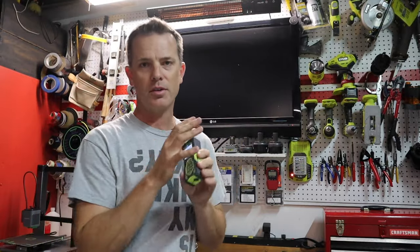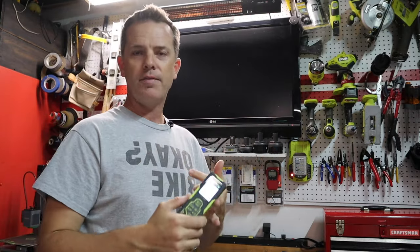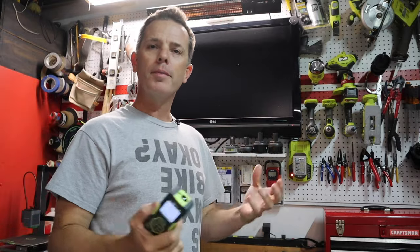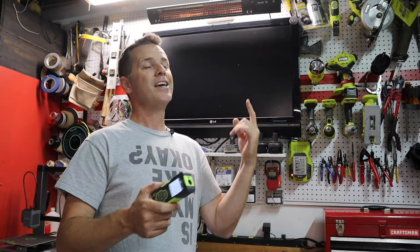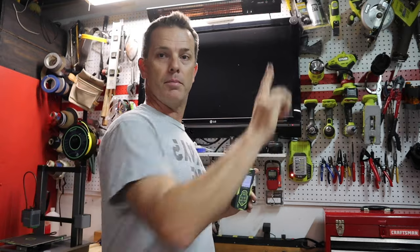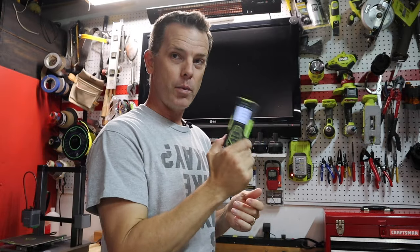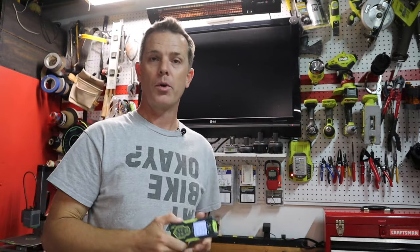You can also go metric with this if you have to. This is a big help if you're doing things like air handling or HVAC — it's very easy to calculate cubic footage even in a huge room. One thing to be aware of though: in my case this number isn't really accurate because I have a vaulted ceiling in here. It's calculating cubic feet by taking three measurements but not taking into account the vaulted ceiling. So you might have to do a little bit of subtraction if you've got things like that going on in your space.